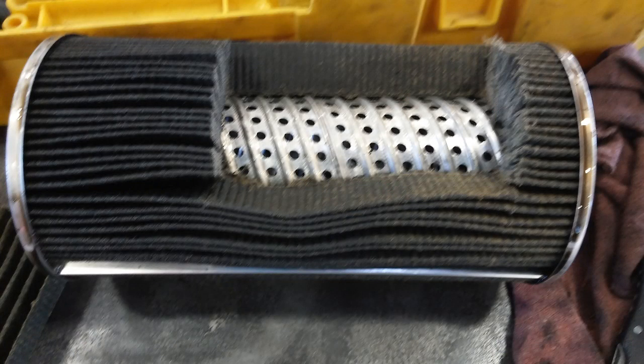The reason for an earlier first oil change is you're going to have definitely higher than normal metal in the oil, and your oil filter is going to be holding more metal after the break-in process because not all parts are perfectly machined. So get your oil filter and oil changed sooner. After that first oil change, you're good to go on your normal 10,000 or 12,000 mile interval.